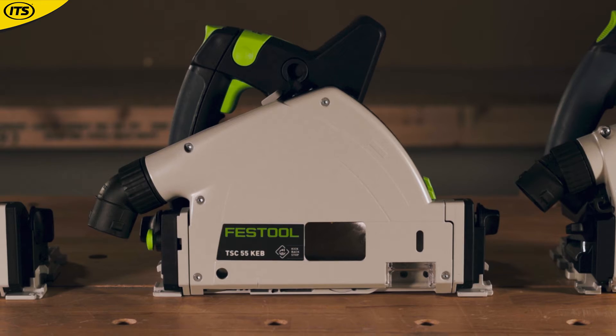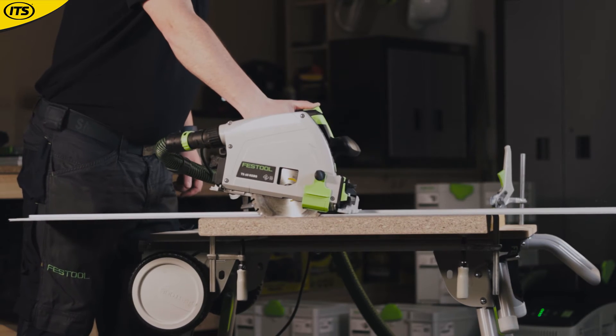If you've heard of Festool and you're looking for a gateway into the system to see what it's all about, the TS55 is a perfect bit of kit to pick up. But if you're looking for more versatility and a little bit more safety, the TS60K has a built-in function called kickback stop — so should the saw try and kick during the plunge cut, it will shut down quicker than a blink of an eye.